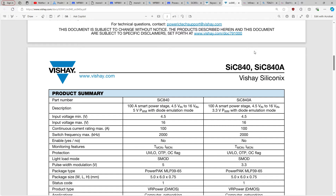Potentially there was some variable I didn't account for — maybe the Gigabyte board was getting slightly more airflow over the VRM. For this testing, I had the radiator not blowing air at the board — the fans are in push configuration away from the motherboard — so there's minimal chance of them affecting airflow around the board. Convection is so weak at carrying heat away that the gentlest breeze is going to ruin your measurements.